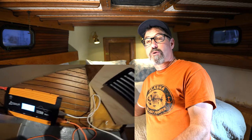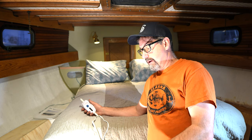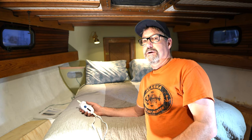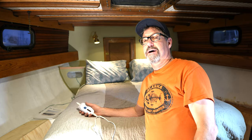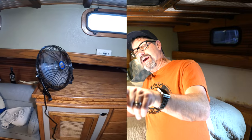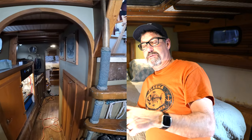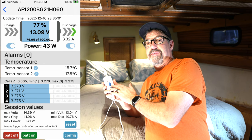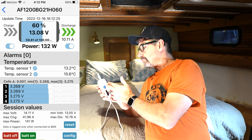What I like is it'll record exactly the consumption overnight. One thing I ran into is you can't adjust search watts on this inverter, so when the electric blanket turns off, it doesn't kick back on. That's easy enough to fix — I've got a little fan back here blowing a little warm air. It's going to probably be too hot tonight, we'll see. The fan runs at 55 watts, and when we add the blanket, that adds another 90 watts or so, so we're up at 138 watts. Of course it cycles on and off, and that's why we need to do this testing.